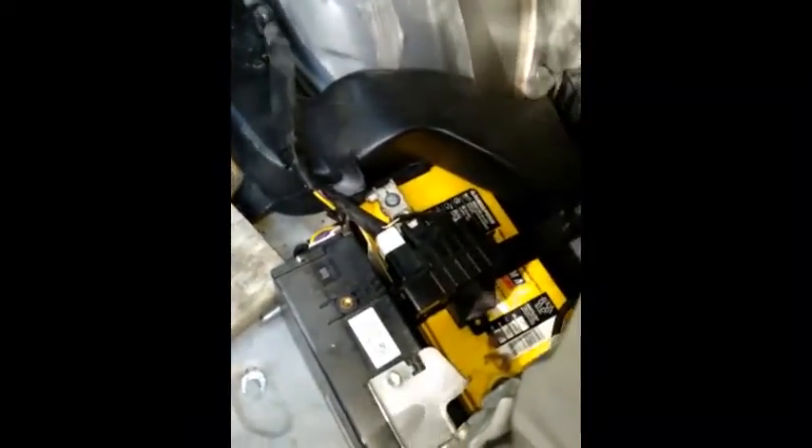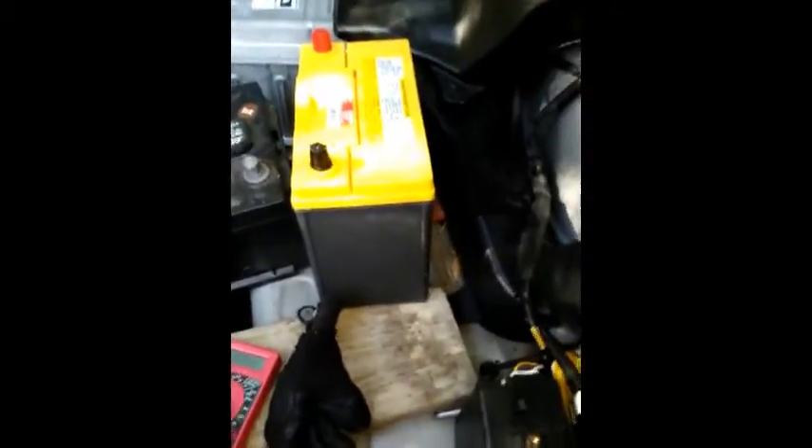Now that I've found a circuit that can recover them, it's not necessarily a death sentence — but still, AGM batteries for solar power systems are not the way to go. Flooded lead acid batteries are good old technology, and the newest options like iron-nickel and lithium systems are better, though more expensive. I would not spend money on an AGM battery for solar at all — if you over-drain in a bad winter stretch, it's quite likely to happen. If you have any questions, I'm always happy to answer them. Thanks for watching.